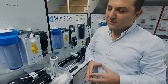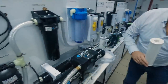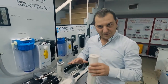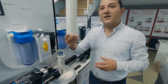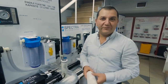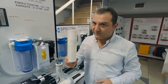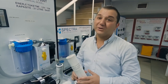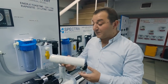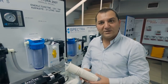You've got water coming in through an accumulator and a 5-micron filter. The package includes a sea strainer first, then the 5-micron filter. How long the filter lasts depends on the water — if it's dirty, you need to change it more often, so check it regularly as it's very important for the pump. Use the original filters, as non-original ones can cause problems. For Spectra filters specifically, you can wash them a couple of times and reuse them.